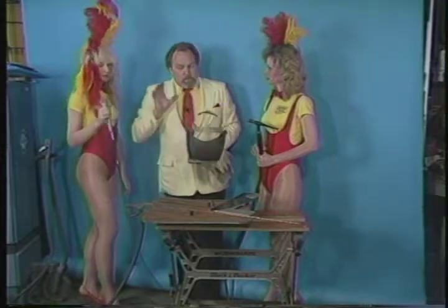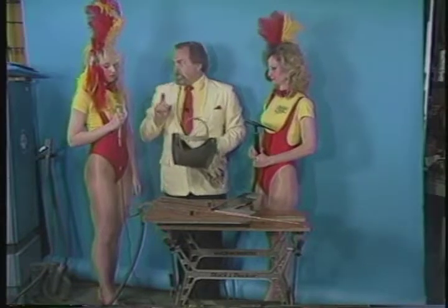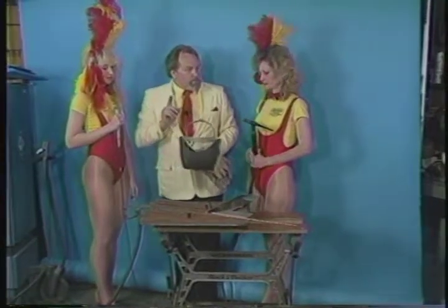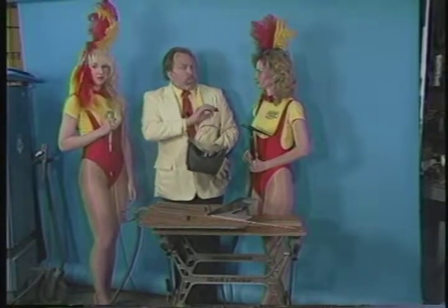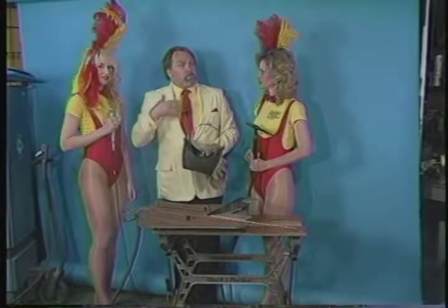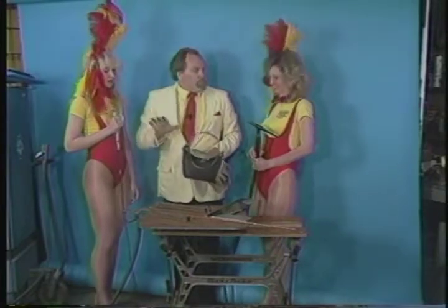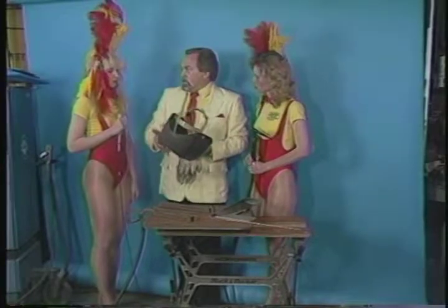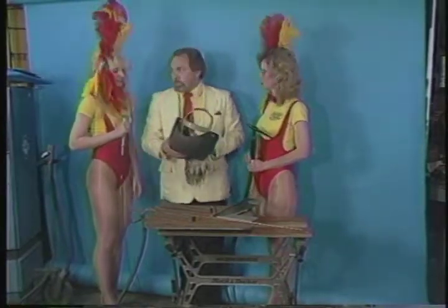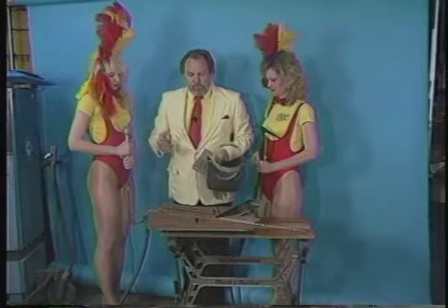Again, I want our audience to know that this kind of welding is big time light, and you can permanently damage your eyes just by looking. So you don't do that. Now there are some forms of welds that aren't that serious, oxyacetylene weld, but as a rule of thumb, don't look, because you might not be expert enough at welding to know what you're looking at, and you're going to end up injuring your eyes. Don't look into any weld. Yeah, don't look into when people are welding. Right. And on Heliarc, now this, as we've demonstrated to you girls, these masks, you almost can't see through them. You can almost hold them up to the sun and can't see, these are real dark, whereas for oxyacetylene welding, it's almost more like a sunglasses kind of a deal. Right. So it does make a difference, okay?